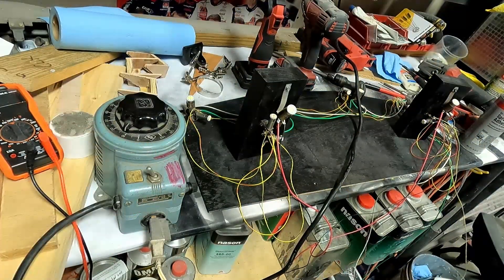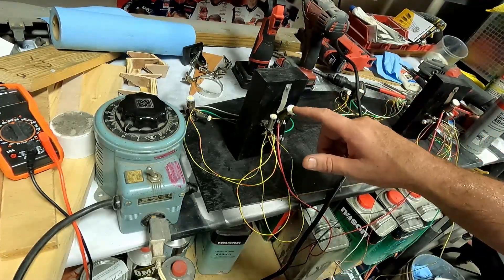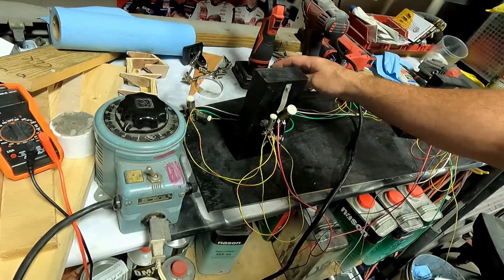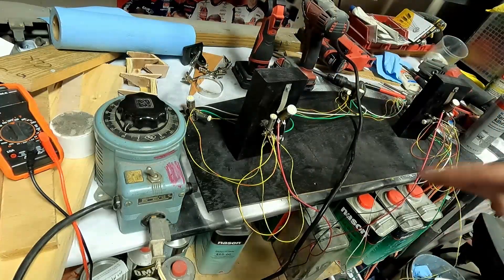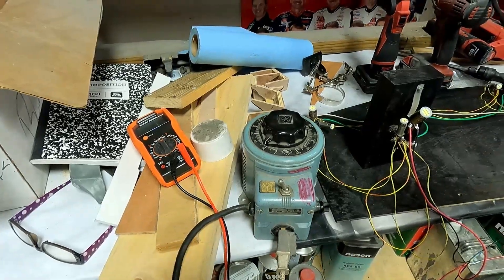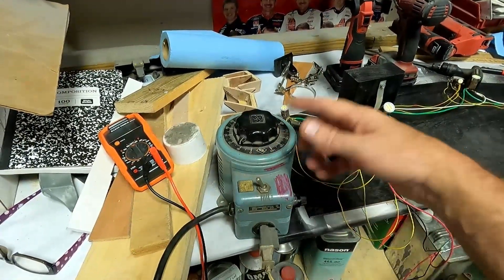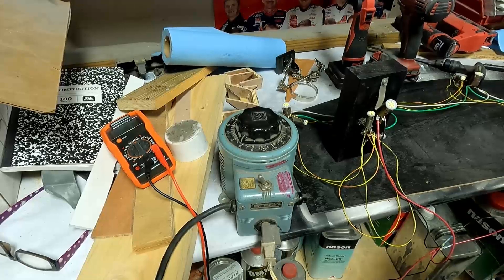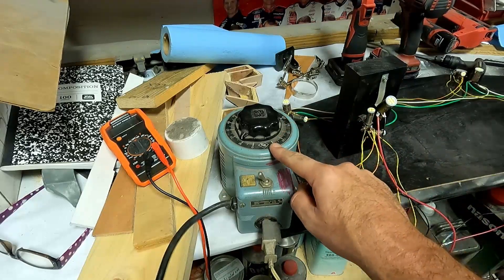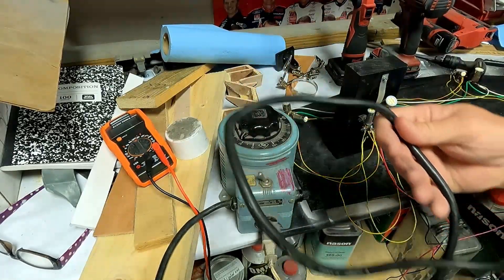The harness is complete and everything works. These are all AC flashers at 12 volts and 5 volts for the GI lights. That's how I test all my lights. It converts the AC power from the wall — you can see it just plugs in, and it's got an output that runs from zero to 140 volts AC. It takes the 110 outlet and can crank it up to 140 volts AC. That's what I test everything with, so get one if you can.